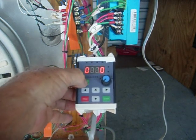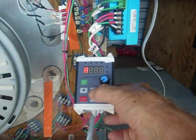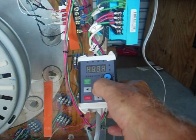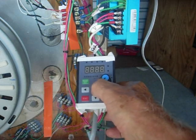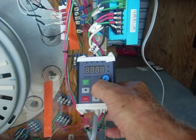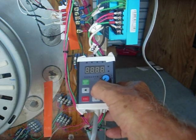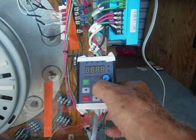If I press the mode button, it shows me the A parameter. I can pick any one I want to work on. A is for speed, C is for current. There's another parameter I'm not sure about so I just keep it off. F is for acceleration — I use two seconds as the motor starts.